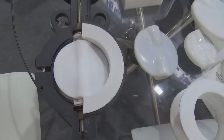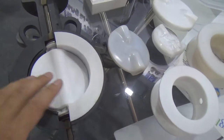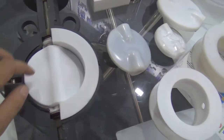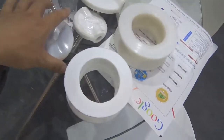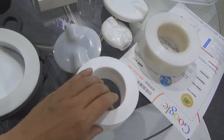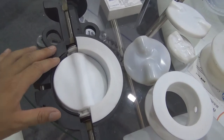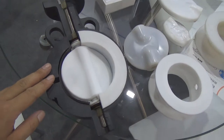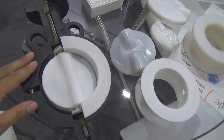Now we can see very clearly about this kind of butterfly valve - we are going to use the PTFE to protect the valve body and also use the PTFE to protect the valve disc. We can also use this kind of material to protect the body too. So when we use this kind of valve in the flow control system, all the valve body is already covered by the PTFE, so the corrosive flow medium will not destroy the valve body and the valve will have a very long lifetime.